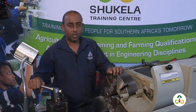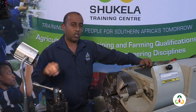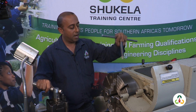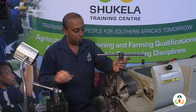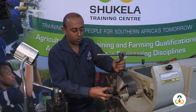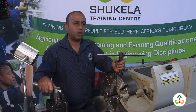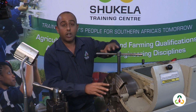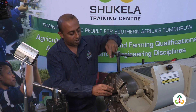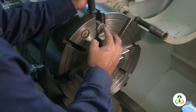Let's look at the four-jaw chuck and what's different about it. A three-jaw chuck is a self-centering chuck, meaning if I put my key in and turn one screw, all three jaws close at the same time — similar to the drilling chuck on a drilling machine. A four-jaw chuck is also called an independent chuck because if I loosen or tighten one screw, just one jaw moves.